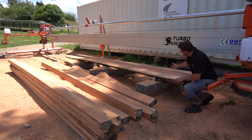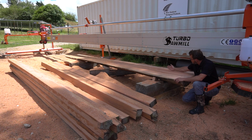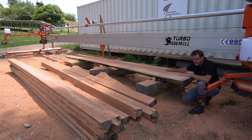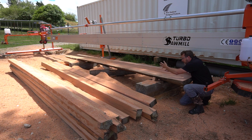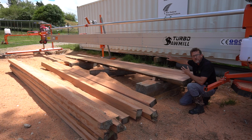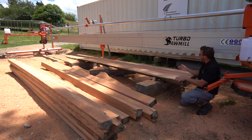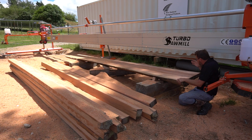What you would have noticed is as I was coming back in the vertical, you saw a little bit of chatter. And that's quite common when you get into the lower of the log. So in that situation, all you have to do is swing up into the vertical and drive forward in the cut, and you'll see that just completely go away. So if you're starting to get a little bit of bounce like this from your log being too light, reverse the pattern and drive forward in the cut. Come back, forward in the cut, and then cut them all free sectionally.